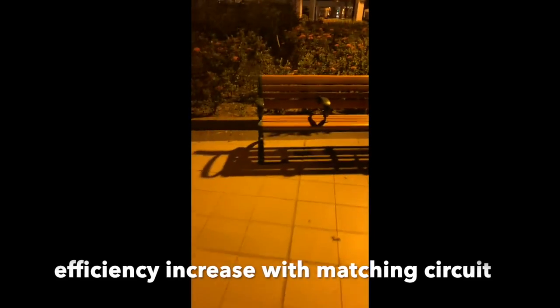And if you choose one of the suggested antennas, we can provide the matching circuit for you, so that it can maximize the power of the antenna. So for the external antenna, without matching, it comes to about 60 meters. For the chip antenna, of course there is no way to maximize it, because of physical limitation, so it is shorter. But for the external antenna, I think 60 meters is good enough.